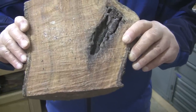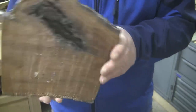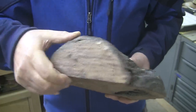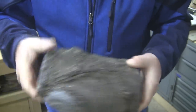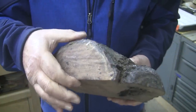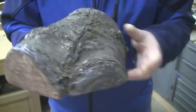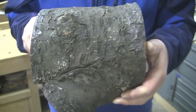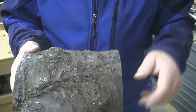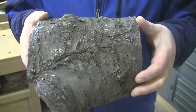We might not even get into that part because I'm going to be leveling off the bottom. I can just bring the bottom up higher — where it's three inches on this end and four inches on that end, we might end up with two and a half inches or so, and that's okay. A two and a half inch deep bowl instead of three inches — we're just going to deal with it. It'll be a live edge turning so this will be the top. I'm going to take this over to the drill press, drill a flat spot for my woodworm screw somewhere in the middle, and we'll get it mounted up and get to turning.